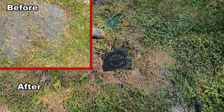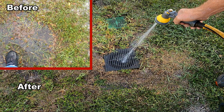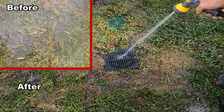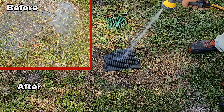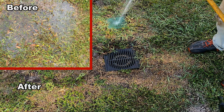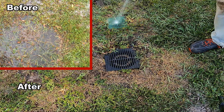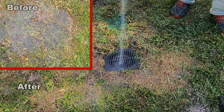Vertical drainage, less than $10 — we solved this problem. The Boffman tile worked and it's working really good, but it's a little bit slower. If I let it run, it's going to back up on me a little bit. That's the eight-slot Boffman tile — some people call it the French drain man pipe, but it's really Boffman tile. And this is the ADS that you can buy at Lowe's or Home Depot. Look at that — takes water all day. Come back, you can solve those little puddle problems in your yard.